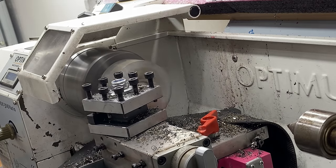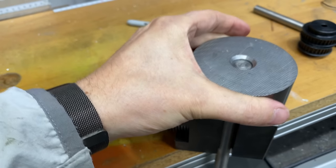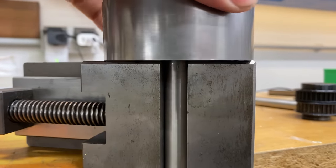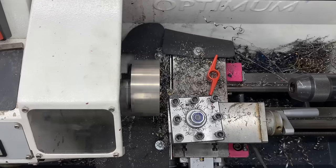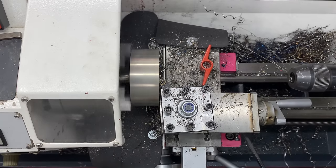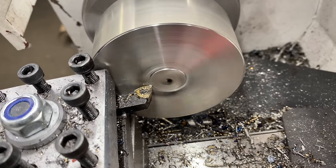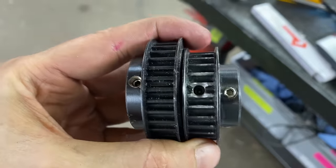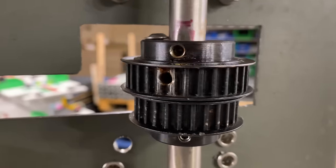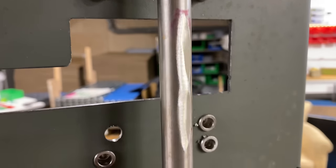The section of track it's riding on is just too thin — only six millimeters of steel. Here I'm adding the shaft to a precision vise to make sure the wheel is on there perfectly at 90 degrees. I super glued it then welded it, and here I'm truing up the surface. This mini mill really struggles, but now I've also changed to belt drives and added a lot of grub screws.